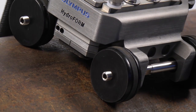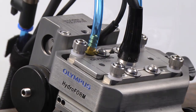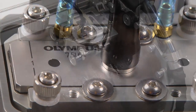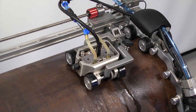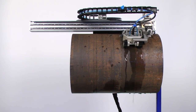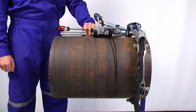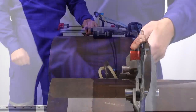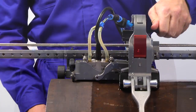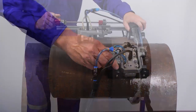The Olympus Hydroform Phased Array Corrosion System, designed for use with the OmniScan, provides high-resolution thickness C-scan mapping to include thickness readings, flaw detection, sizing, and characterization of in-service piping, tanks, and vessels. The Hydroform utilizes a water column concept with A-scan surface synchronization for optimized coupling that eliminates the need for hard wedges and allows high-production corrosion mapping without the need for motorized scanners.